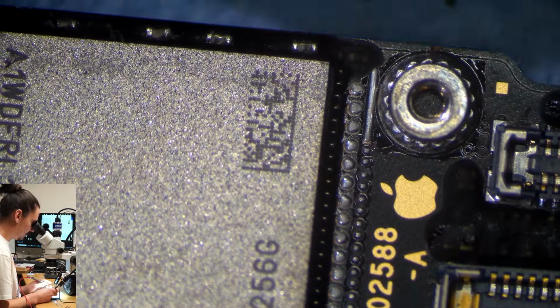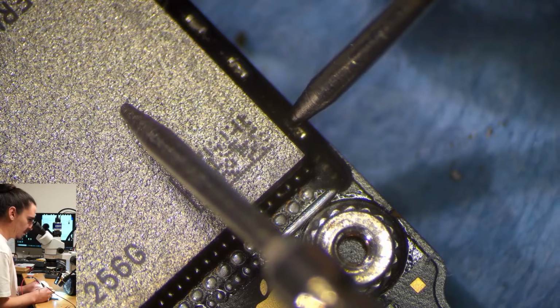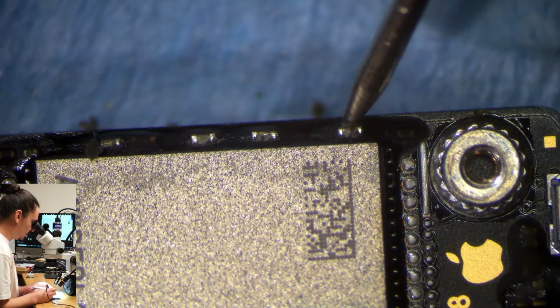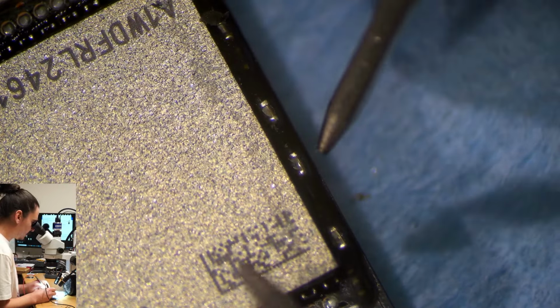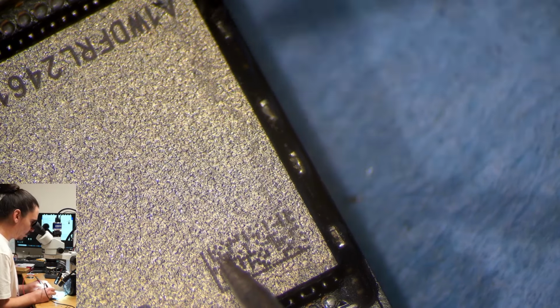Are those the same line? That shouldn't be the same line, but it's very close. This is 0.269, this is 0.27, and I have a 0.002 diode mode between them, which means they're almost fully short to each other. This is 0.41. And this is 0.269 again.